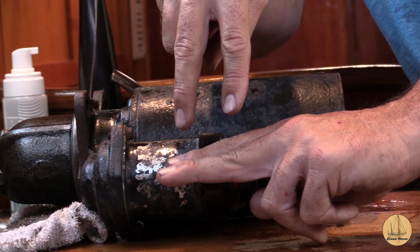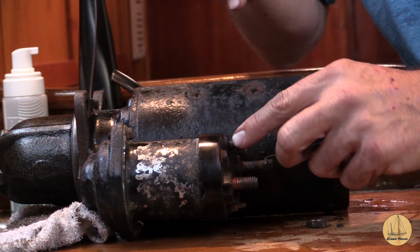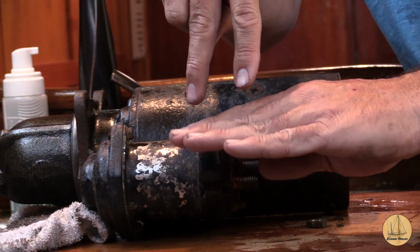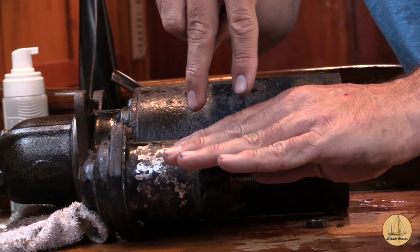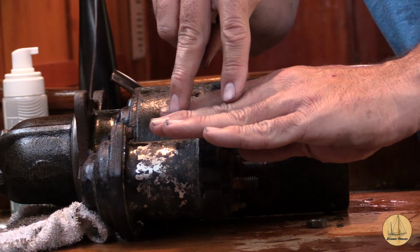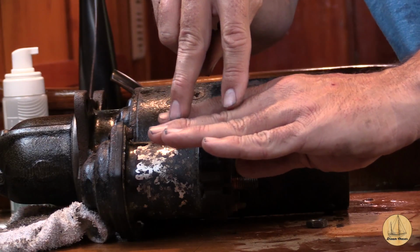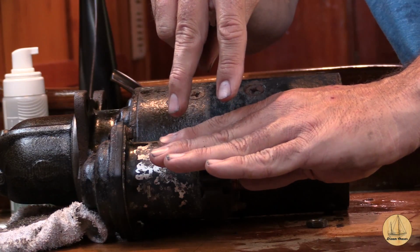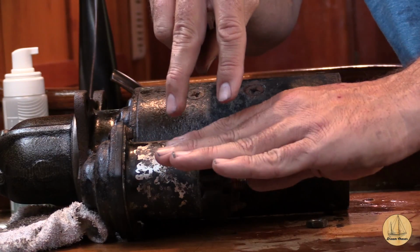What happens is when you turn your key into the start position, there's a small lead right here. That is a very small electrical current inside the starter solenoid. A solenoid is just a device that actuates. There's a metal disc, and when you turn your key, that metal disc lifts up and makes contact with those two items, thereby letting current flow all the way through the two leads, from one lead across that disc to the other. That's kind of how a starter solenoid works. You let go of the key and then this thing drops down, but at that point it's already started and your starter is now disengaged. Turn your key, that's kind of what happens.